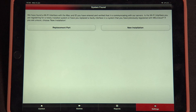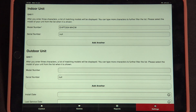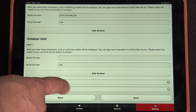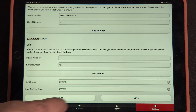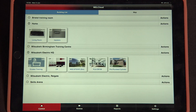Once it's logged that, confirm it's a new installation. On there you can select the indoor unit, give the serial number, provide details on the outdoor unit, and even give the date of the install and when it was last serviced. Set today's date as the install date and the last service date. Press save and that logs all that information.